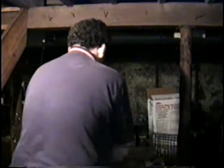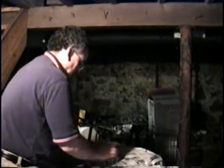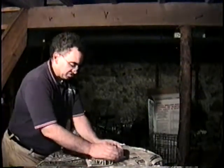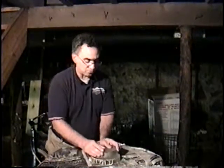Maybe a little longer with the 120 also — just keep going around the barrel until I think I have a relatively smooth curve. I'll then move to number 220, 45 minutes there; 320, 45 minutes there; 500 — and that's the last of the carborundum grades I'll use. I never go below 500. The bigger the number, the smaller the grain. Now, 500 carborundum is roughly equivalent to 25-micron aluminum oxide. But carborundum is a really, really coarse grain with very brittle, very sharp edges.